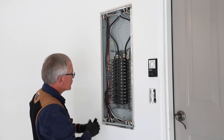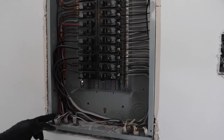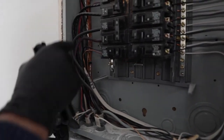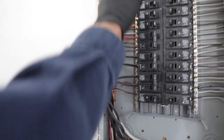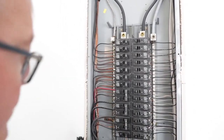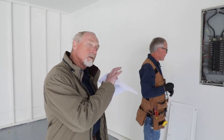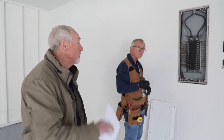Now I'm going to look at the breakers and check for any tripped breakers. I don't have any down at the bottom. I'm looking for missing connectors and damaged conductors. I'm also going to check and make sure the ground is bonded to the enclosure and is isolated from the neutral. In a subfed panel, you don't want to see any jumper wires or tie bars between the neutral and the ground. This panel looks pretty clean. I do like to point out that it is out of date by today's standards because it doesn't have any arc fault or GFCI breakers, but there is no requirement to bring it up to today's standards.